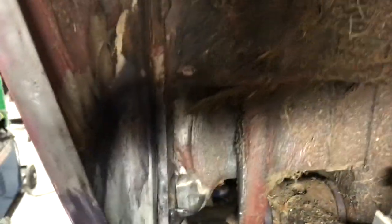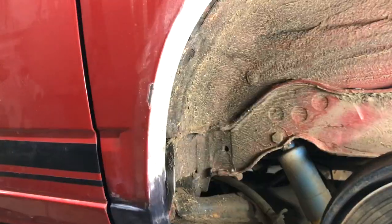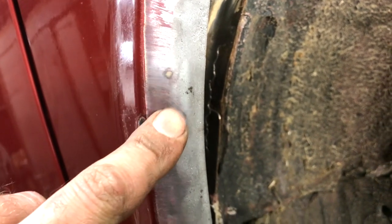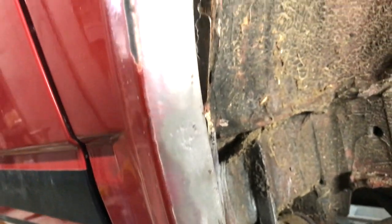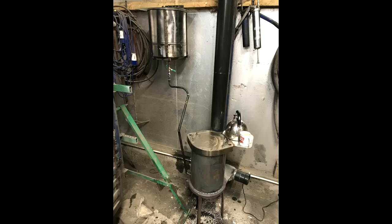The rest of the arch is in good shape apart from some minor corrosion to remove. I've done this with a spot blaster and then left it for a day. Where you can see rust has reappeared is where the rust hasn't been successfully removed and the process needs to be repeated. When rust doesn't reappear after a few days it has been completely removed. All there's left to do is have a cup of tea.